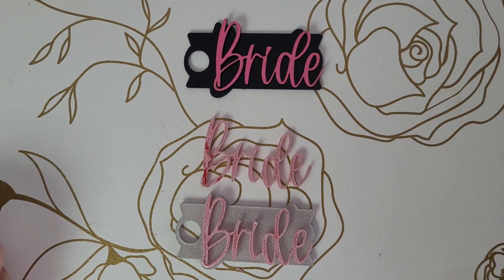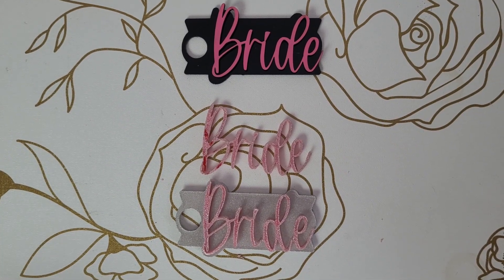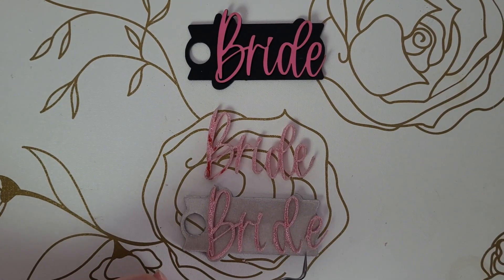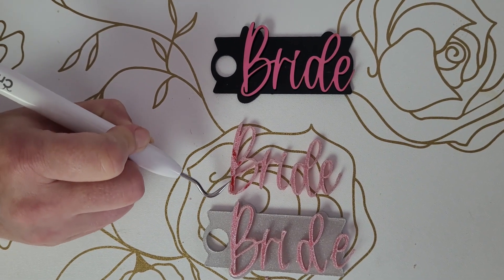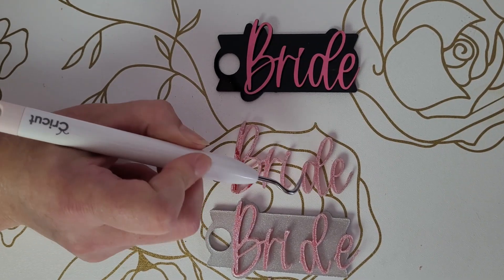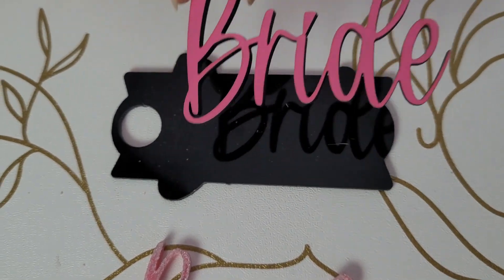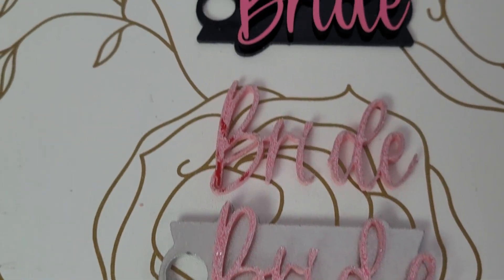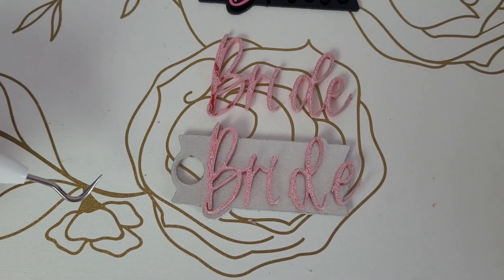Let's talk about the results of this project. The one where we took the protective sheet off first came out good, but it was still delicate — I had a hard time getting all the little pieces out and it broke in a few spots. The one where we didn't take the protective plastic off got so melted that I couldn't get it off even with a weeding tool. The wood version looks fantastic — I can pick it up and move it and it doesn't fall apart. So if you want to make Stanley toppers, I would recommend using wood. If you want to cut acrylic, use big chunky shapes, not small intricate things.